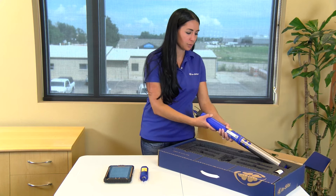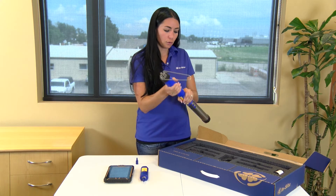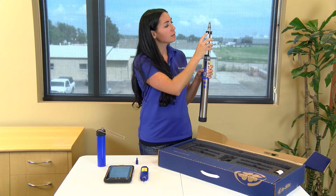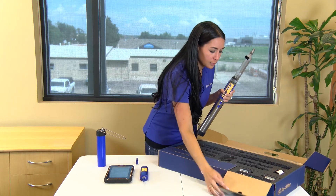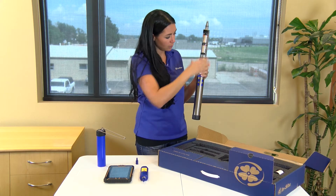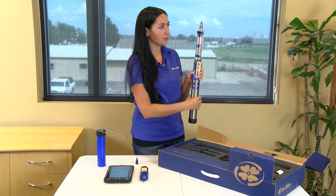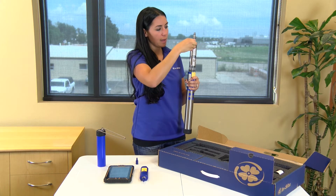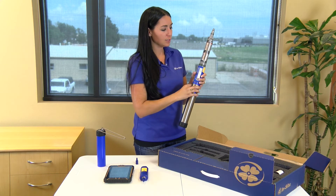The first thing you want to do to set up your instrument is pull out your sonde and remove your dust cover. This really just helps to protect from dust and excess moisture on your cable connection. So the first thing we will start with is installing the batteries. You want to remove the battery cover, and you can see there is your spot for your batteries. There is a micro SD card right here, so something to keep in mind for duplicate data backup. As soon as you power the instrument, you should see your LCD come on and be displayed. Two other things to point out about the battery cover: you have a little switch right here that will tell you whether or not your battery cover is fully closed, as well as a little hide-a-key on the back. We provide additional tools to help you, but this can just act as a backup if you're out of the office and don't have your tools with you.